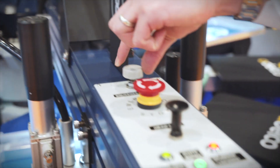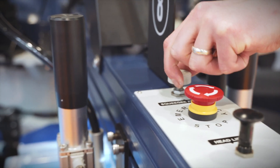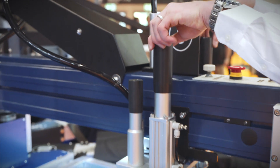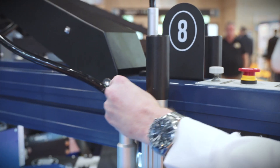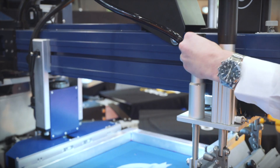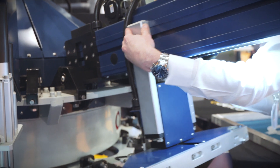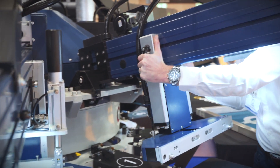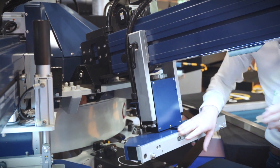All functions are controllable on the print head by the membrane switch. We have a squeegee pressure regulator option — independent to each head or a single unit that adjusts all heads together. Squeegee pressure adjustment is very simple just by rotating the two knobs, with self-levelling, and exactly the same for the flood blade. The rear screen adjuster is fully adjustable for any size of screen — even small screens can simply be adjusted and locked with tool-free knobs.